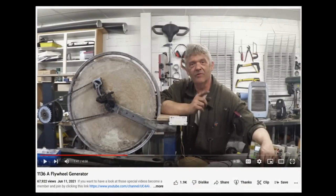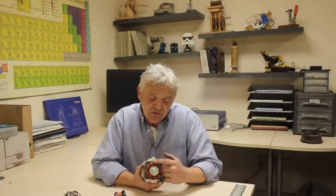We've looked at this idea several times on the channel. Here's an example where we took a speaker magnet, put a metal shield, bent the fingers to bend the flux, and used that as a generator. We also did a very similar thing with a bicycle wheel. The advantage is it's cheap - unbelievably cheap. If you have to wind coils in that kind of stator, they're quite difficult to get in place and much more expensive due to machining. Winding a single coil and bending steel over the fingers makes the motor or generator incredibly cheap, as evidenced by the price of these fans - just a few dollars.